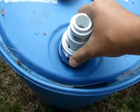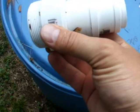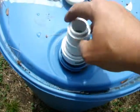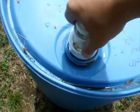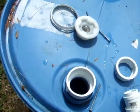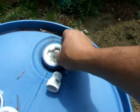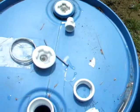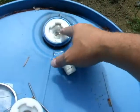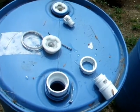This fitting obviously fits all together and makes one nice, neat little reducer — there are five parts in that. I don't like that idea. So what I'm going to end up doing is probably just going with this piping, because it screws directly into the barrel, and use two and a half inch PVC to connect my barrels. I see people create this elaborate air system to let air in, but when you put water in, air is going to come out, and when you take water out, air is going to go in. My thought is to just put a hole here with a screen — you've got to keep the mosquitoes out. If I do this on each barrel, I don't have to connect them with some elaborate venting system; each barrel itself will be vented.